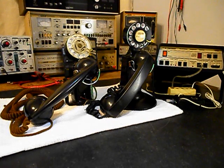We want to install modular line ports on the inside of these units so that when they are installed, you can bring any length, any color line cord that you choose into the base of the unit and plug right into the modular line port. Makes for a simple, easy plug-and-play connection. We need to rewire these units the way we want them wired to work the way we want them to work. We will also install any electronic circuit that we may need during the conversion.